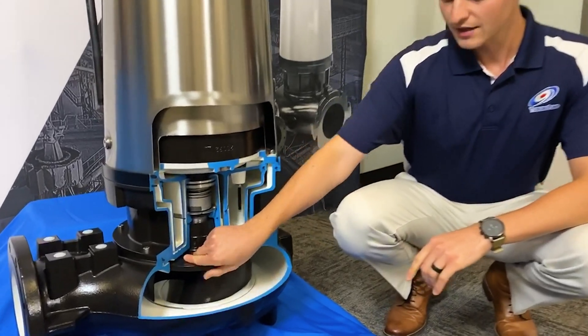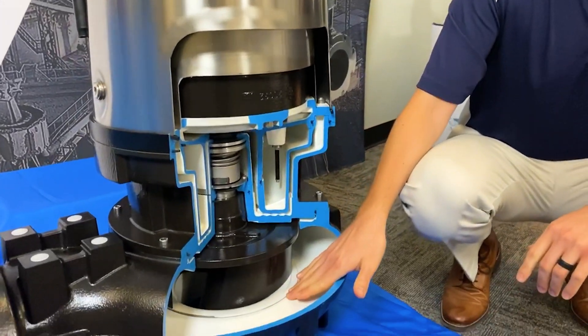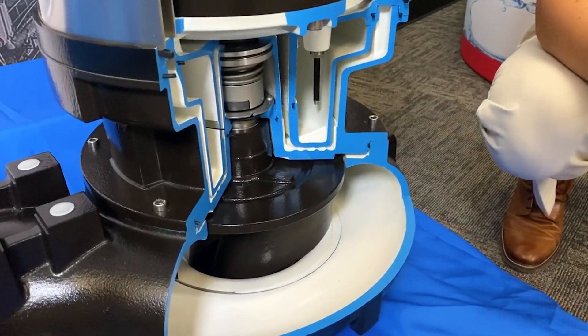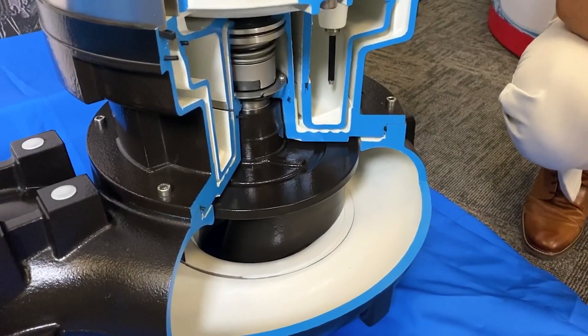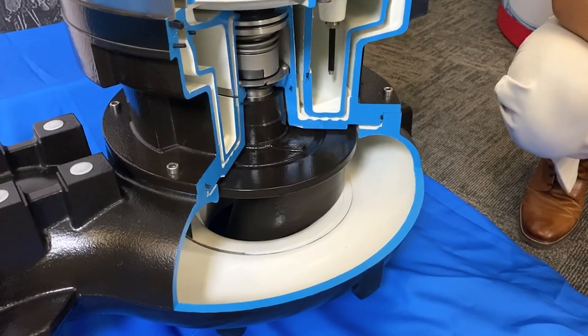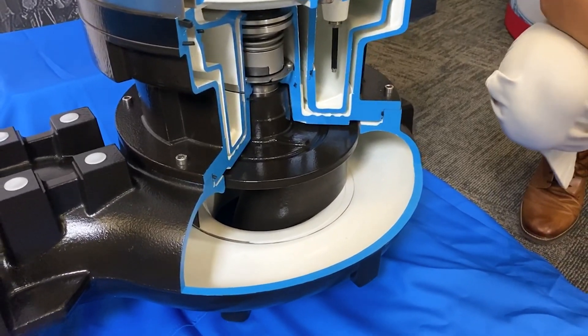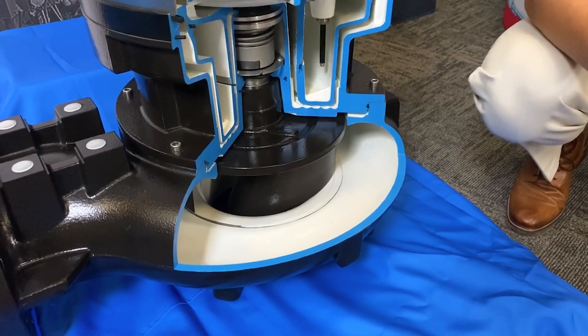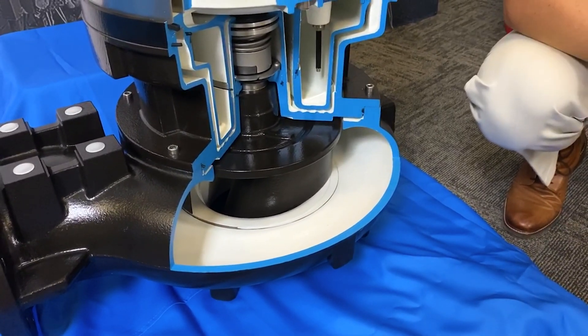What I have here is the open channel. This is kitted with an anti-clogging system in the volute to ensure solids passage and prevent any blockage. The chopper will cut materials, while the vortex style will have optimal solids passage. The grinder really macerates those materials, and the high-pressure style is for high-head, low-flow applications.